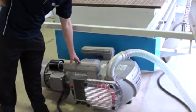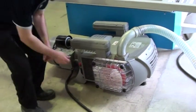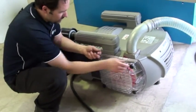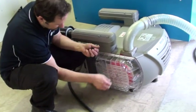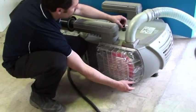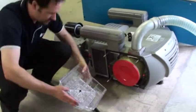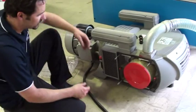The model of vacuum pump today is a VTLF250. This will look very familiar to many people out in the industry. This is a newer model where there's only two filters. We have an internal filter, which is what I'm basically taking the cover off for now. As you can see, they have a clear cover, so you can actually see how much dust is built up in the filter.